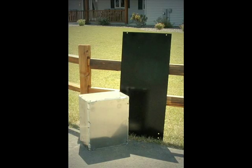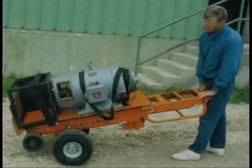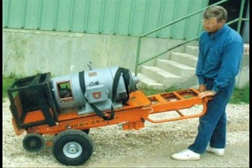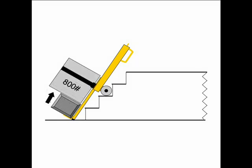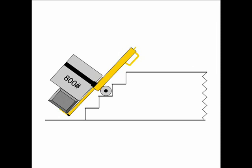The balance box kit gives the ElectroTruck user another alternative to lifting low center of gravity loads. For instance, a motor would be unmanageable on a flight of steps, but with the balance box installed, the center of gravity is higher and the user has to use less effort to counterbalance the load. This 800 pound load on the tow plate has a very low center of gravity — no matter how hard he tries, the user cannot counterbalance it. With the balance box installed, moving the center of gravity up, the load can be counterbalanced more easily, and the user has no problem balancing and powering the load up.